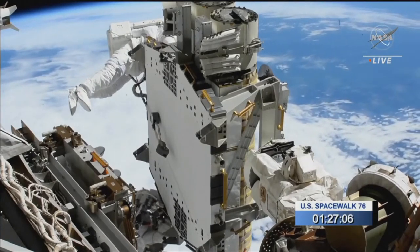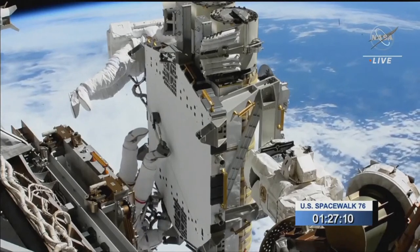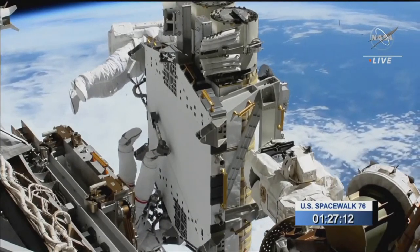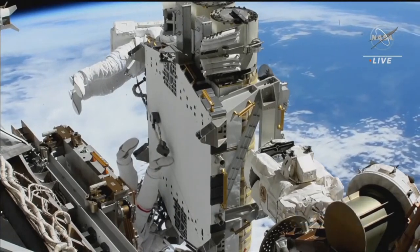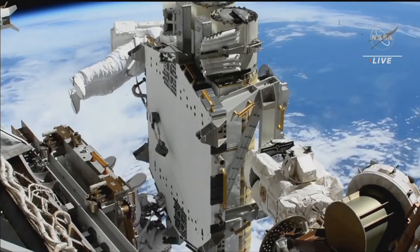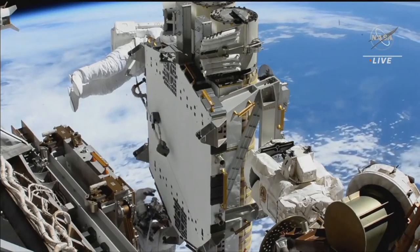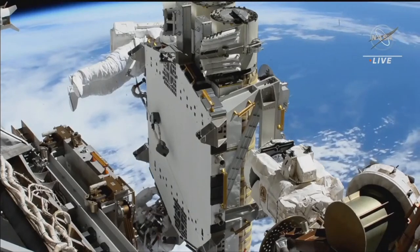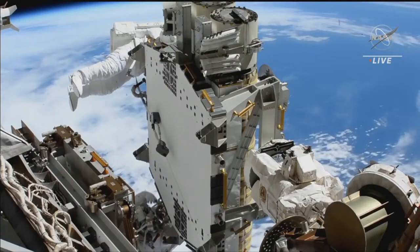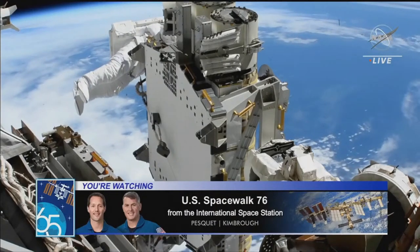Copy. We'll now be releasing the iROSA FSE bolts. Starting with Charlie 11, in your current location, we'll be releasing it 27 turns only, which is just halfway, so not fully releasing the bolts. And your settings are Bravo 3, counter 3. Bravo 3, counter 3. Copy.